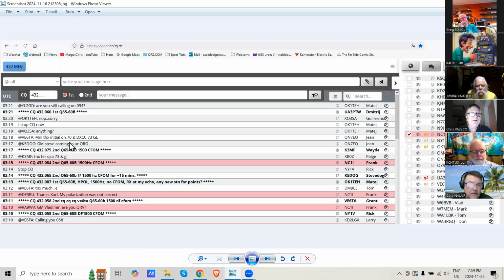And this is where I will get Frank, this fellow I was listening for. What frequency is he on? Well, there he is. He's calling CQ at 432.084. He's second. There's first and then there's second in FT8 for those people who played with that. This is the Q65 60B mode he was on. He's going to be at 1500 hertz on the audio spectrum, like Jim was talking about. And CFOM, that stands for constant frequency on the moon. And we'll talk about that in a bit.